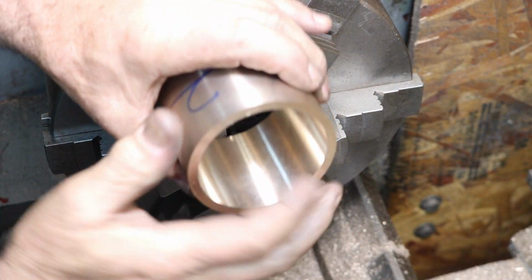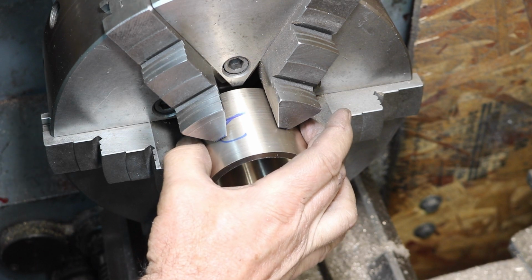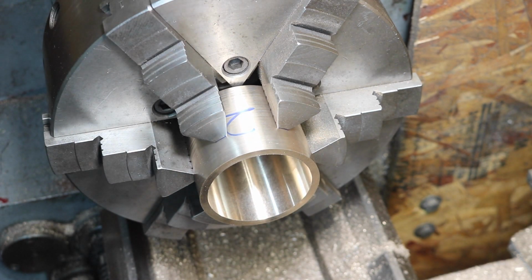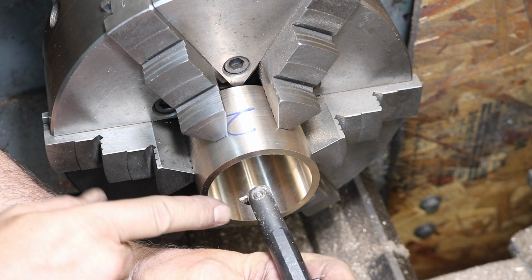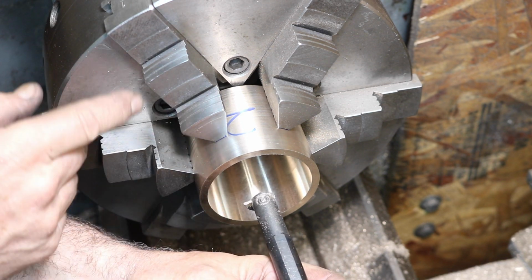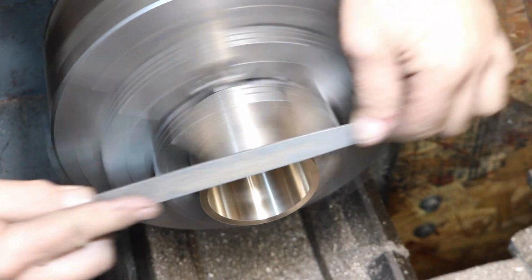And we're going to put in the felt ring grooves. I'm going to use this inserted grooving tool. It's 80 thousandths wide, so I'm going to flush it up with the end, go in 100, and then go to 250, and we're going to go 60 thousandths deep. This is the parted end.